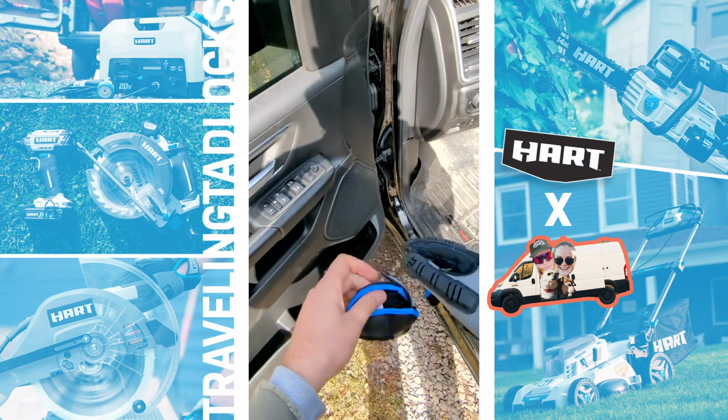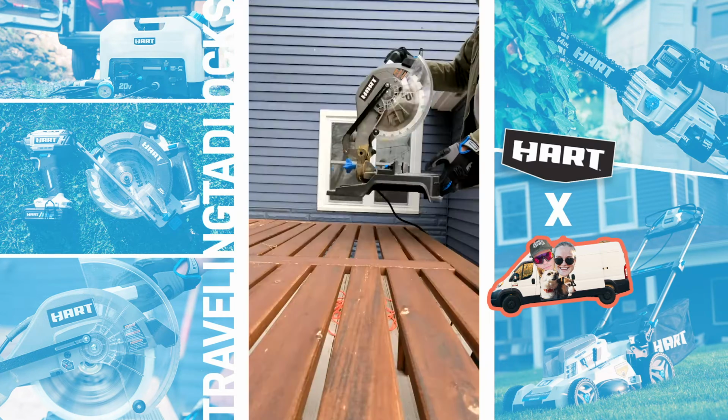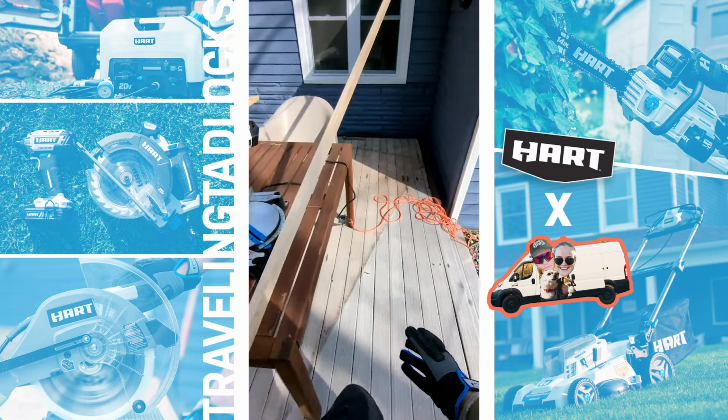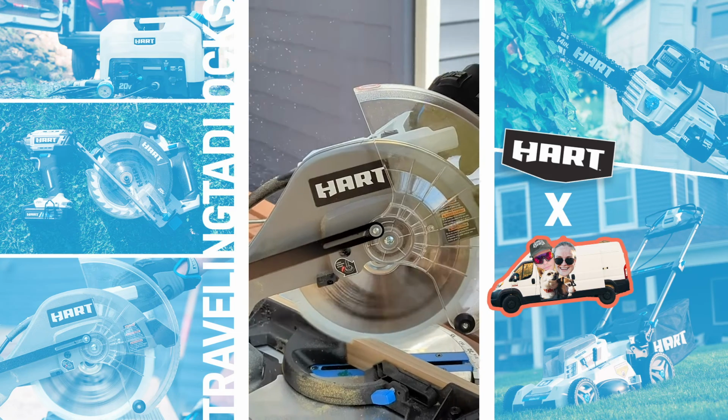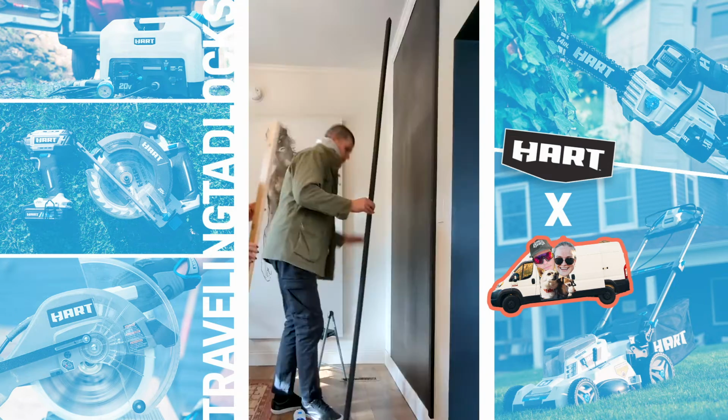While Meg was busy painting, we started loading the wood and prepping it to make our cuts. We used 1x2x8s and cut each board at a 45 degree angle so they'd sit flush with the crown molding above. After using the miter saw to make our cuts, we threw on a coat of paint and started the process of attaching the boards to the wall.